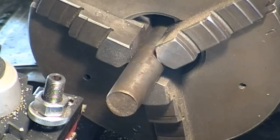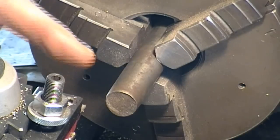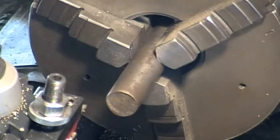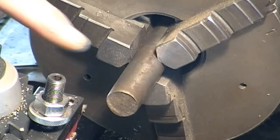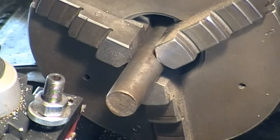I've dug out a piece of three-quarter round, that's about 13 inches long so I've got some spare length on it. The handle will probably be about 10 inches, something like that. This is like a lot of my jobs - it's all on the fly, not sure what I'm going to do till I do it. Got a cut end here, we've got to face that off. Might well put a thread on here whilst this end's sticking out.